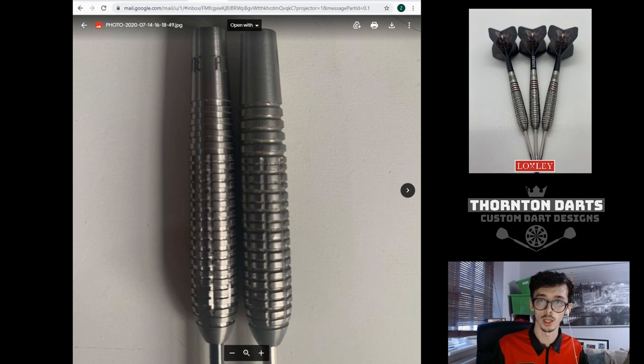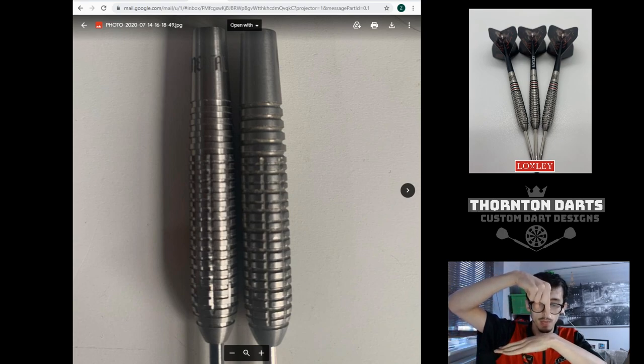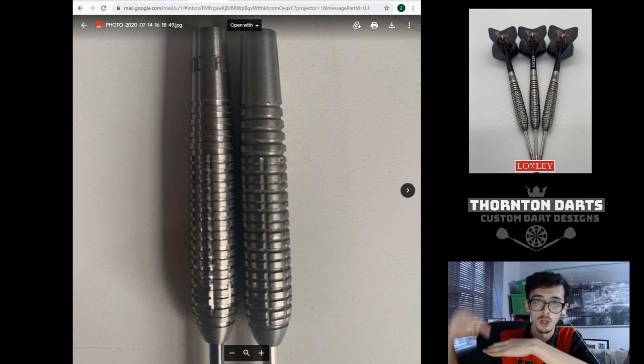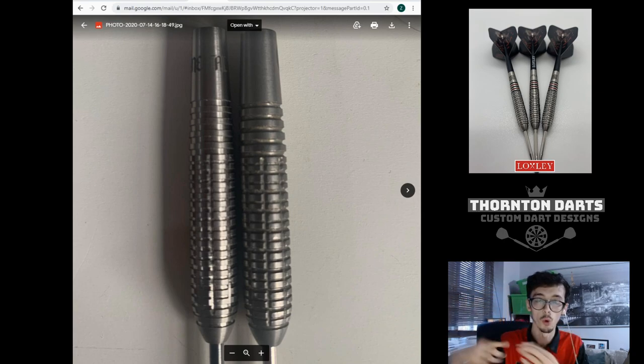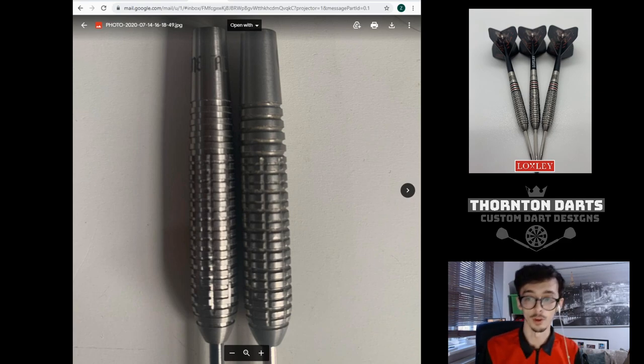On the right-hand side it's made by what's known as a ball nose cutter — basically like a spinning drill bit that comes down to a certain depth and is then moved along, designed to cut along rather than down, usually on a milling machine. They obviously feel different: one's more rounded and less aggressive, and the other feels a little bit sharper. So gauging those differences was important to me.